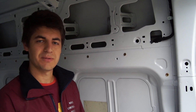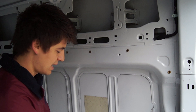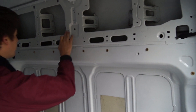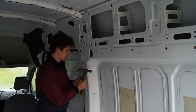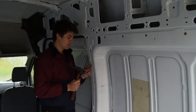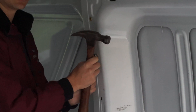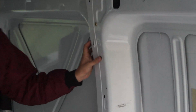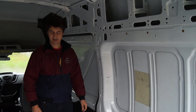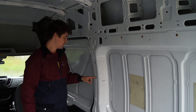It's a big deal for us because we just bought a new van and don't really want to drill holes in the wall — it helps prevent corrosion and it's actually stronger than screws. We're installing them by taking a hammer and finding an existing hole in the wall where we think we'll need a joint. We insert the bolt into the hole, but it doesn't go all the way because of the ribbed joints on the cross nut, so we hold it in place with a wrench and bang it in. You've got to hit it hard because we're working with steel walls.